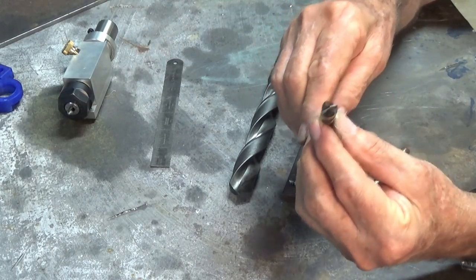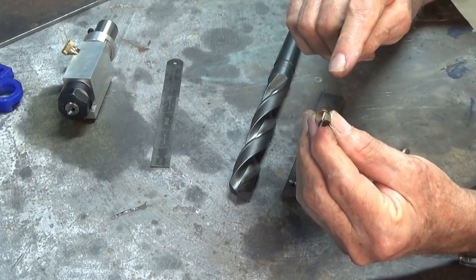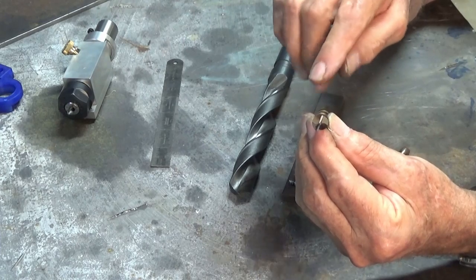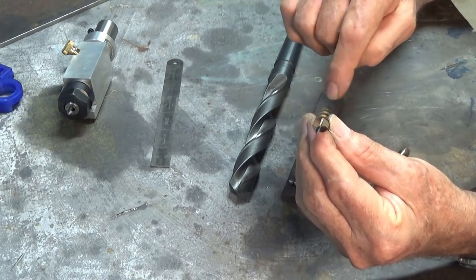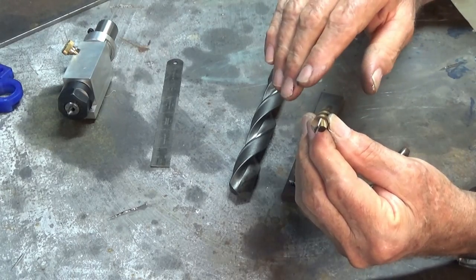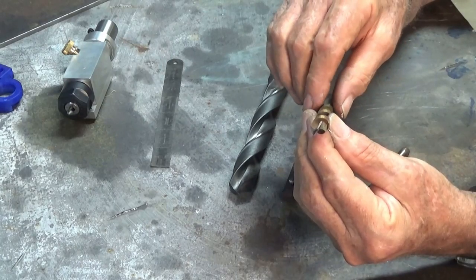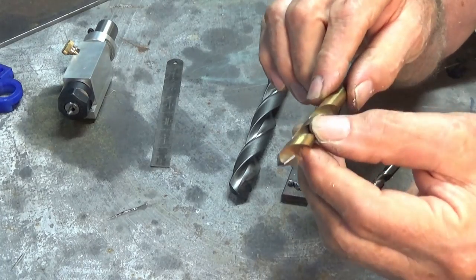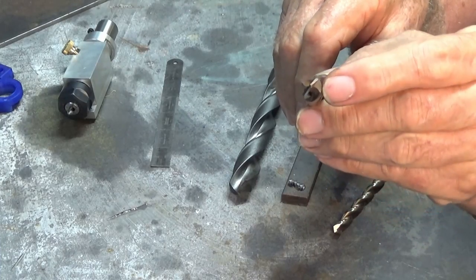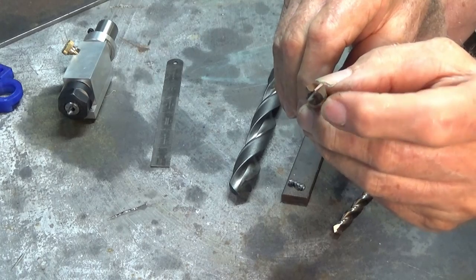So what are the advantages of the 4-facet drill grind? Well, for one thing, it starts more readily, so it won't wander off from a spot that you've located for the center of the drilled hole. It also requires less tool pressure to push through the work, and therefore it produces less heat. But they also tend to drill a bit closer to their nominated diameter. And you can see by looking at that, that it has this very special feature where the intersection between the two facets on each side of the drill intersect exactly on the center of the drill bit.